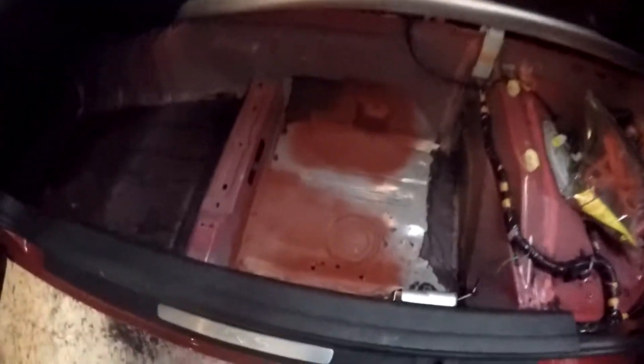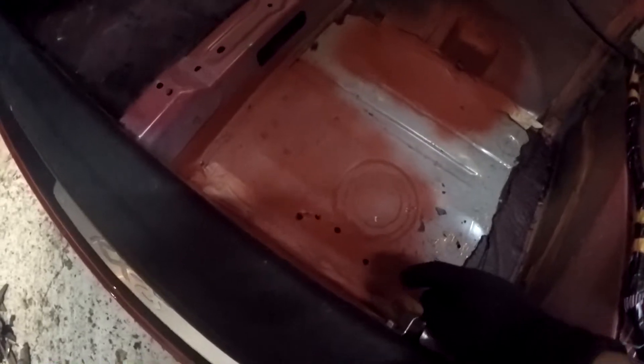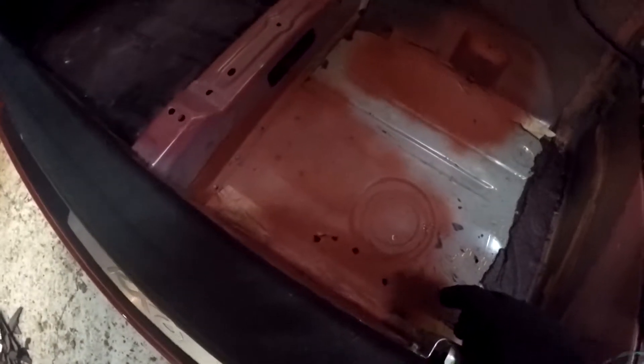I will be doing something about these holes. Don't drill spot welds on a very thin piece of metal — avoid that at all costs if you can. I think I'm just going to have to either fibreglass fill it and then undercoat on the side, or something. But it'll get sorted, it'll be all right.